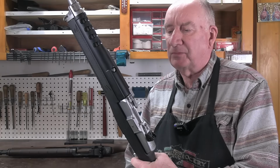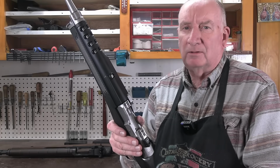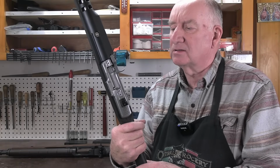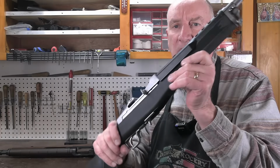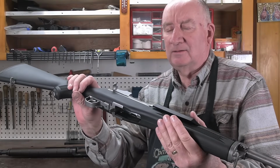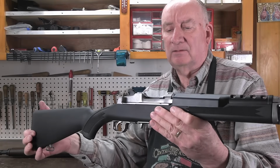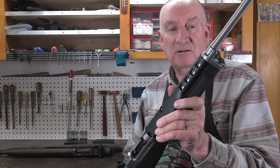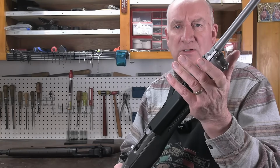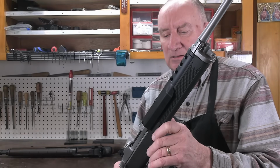I particularly appreciate both of them. I love the M14. It's a very, very beautiful design, which is inspired by John Garand's M1. And just as the M14 was inspired by the Garand, the Mini-14 was inspired by the M14. And I think Bill Ruger did a fine job of taking the best of both and simplifying that which could be simplified, bettering that which could be bettered, which was, I believe, in the gas system. It's a simpler gas system. You know, the M14 gas system will operate, it's self-compensating, and so is Bill Ruger's, simply because it doesn't make any difference what you run through this. It's all gonna throw gases back against the bolt.